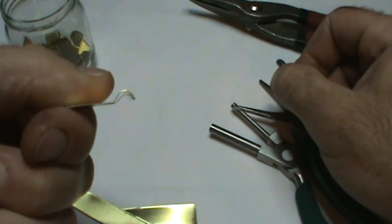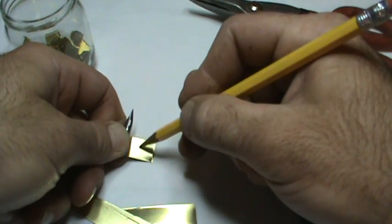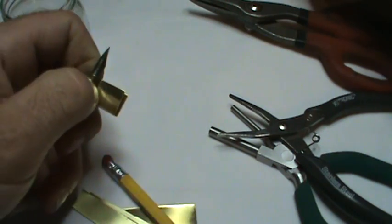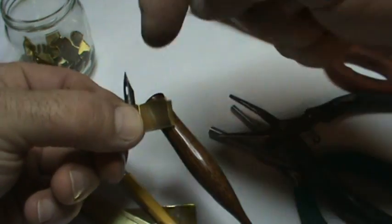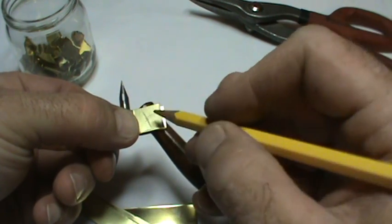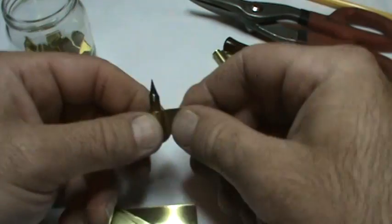Without the nib in it you should have something similar to that. Once it's done, you can take it and cut it at whatever angle you need to make it fit inside the slot of your pin holder, cutting off any excess so that the nib is pointing to the axis of the pin holder. Just take small cuts, moving slightly over and over until you get it where you need it. That's the best way for a beginner.